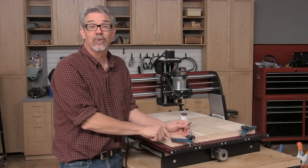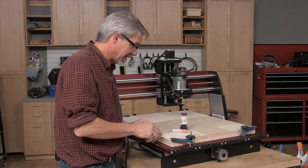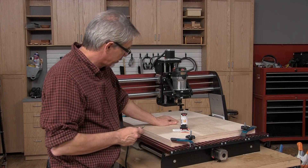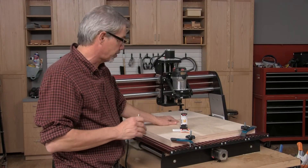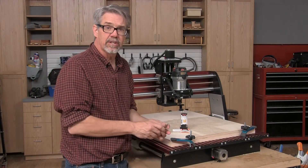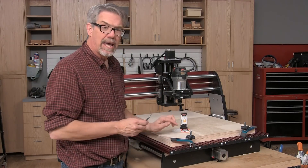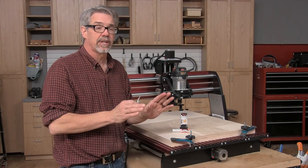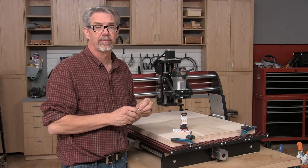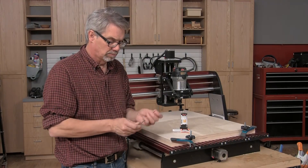You'll notice we're going to put an A in one corner and a B in the other corner, because you get those two pieces out of each piece of plywood. We're going to engrave and cut the hoop out. If you do this properly, you only need to register the X and Y one time, and then you'll change the Z for the engraving or the cutout. The A and B will be notated in the program as 1A and 1B with each of the programs we provide.